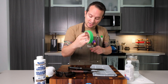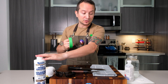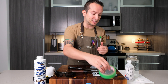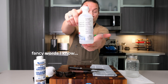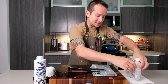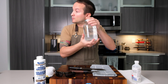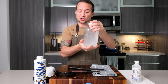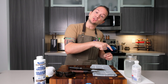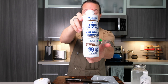I'm going to be using painter's tape to put on the handles of the knives to make sure we don't get any ferric chloride on the handle. We only want it on the blade itself. I also have some isopropyl alcohol to clean the blades, and in this mason jar I have a baking soda and water solution — shaken to make it homogenous — which I'll use to dip the blade into to neutralize the acid after etching.